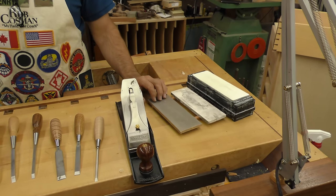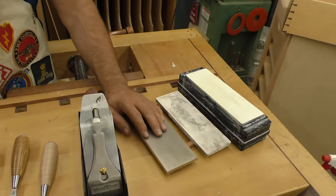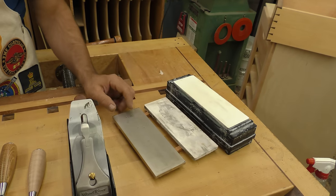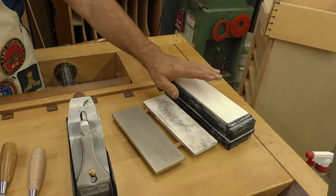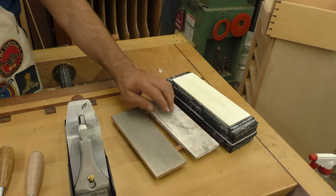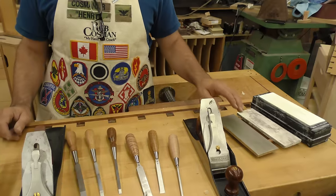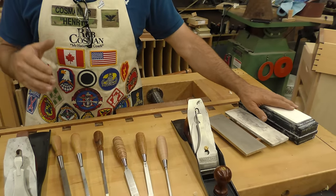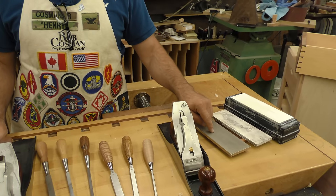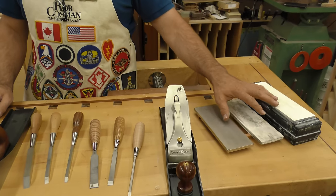I start with a product called a Trend Diamond Plate. This is a double-sided plate with a 1,000-grit side and a 300-grit side on the other. I finish with a ceramic 16,000-grit stone made by Shapton, and this has to be kept flat. Before every use, I spend 3 to 5 seconds using the 300-grit side of the diamond plate to keep it flat. My sharpening of both chisels and planes simply starts here and finishes here. The only reason I have a third stone — a 6,000-grit — is for the initial preparation of chisel backs, when you need to go through a progression of grits like sanding. Afterwards, you're only going to use your 1,000 and your 16,000 to do and maintain the edge. So purchase number one, which I consider one group.